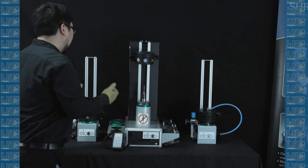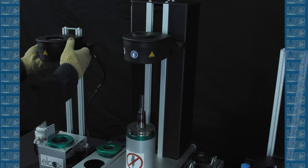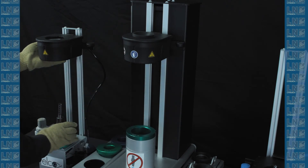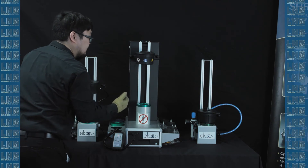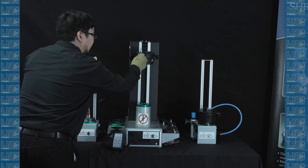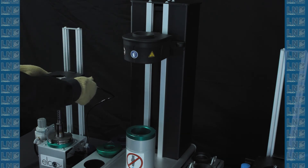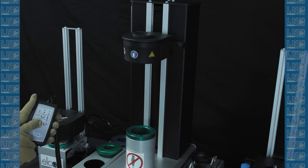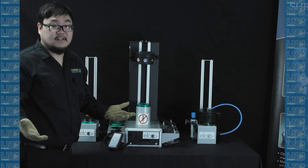Once the head is raised, you can move to the cooling tower again. Raise the head of the cooling tower. Grab the holder and put it into the pot. Lower it. But before you finish lowering, make sure you have the cooling bracket with the corresponding size matching the induction ring. Put the cooling bracket in, turn it clockwise to secure it, lower the head. For the left cooling tower, hit the left cooling button.